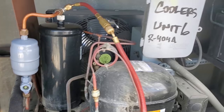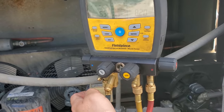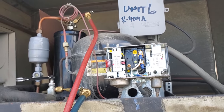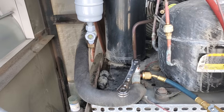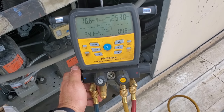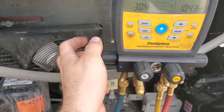I need to turn the pre-cooler on first and then we'll turn the condensing unit on and start turning everything else on too. System is up and running — sight glass is still flashing. We're going to go ahead and purge to there. I better purge these too because I never purged these. We're ready to charge it. We're going to clear up that sight glass, being careful not to overcharge the system because it is under a heavy load right now. We're going to put some gas in it, let it run for a bit, then wait till it gets a little bit closer to set point and then clear it up. Almost there — just letting it slowly clear up. Before I came up here, I weighed that drum down at the truck and wrote the weight on it, so I know how much I've added. I'm lazy and I don't want to bring my scale up if I don't have to — just weigh it down there and leave the scale on the truck. Our sight glass just cleared up. We're going to go ahead and take the service gauges off and go take a look at the evaporators down below.